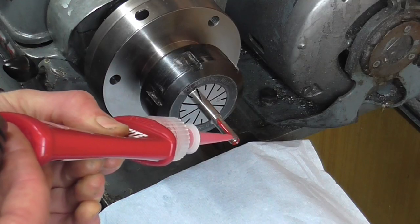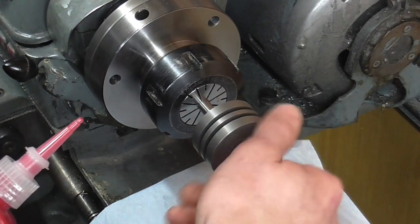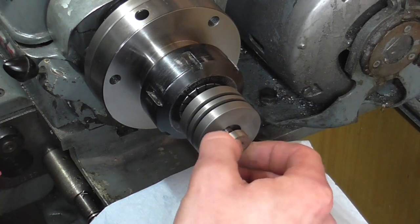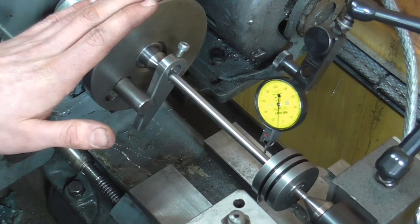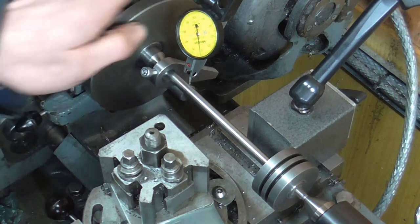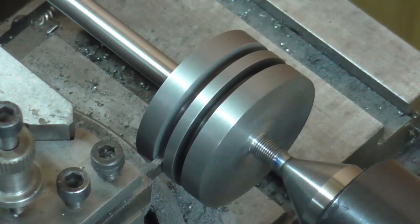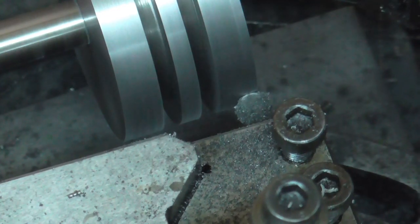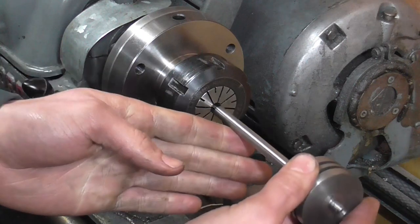On to assembly and I'm finishing the pistons once they're mounted on the rods. So they're being Loctited on with high temperature Loctite. The retaining nut goes on — you don't want your piston coming off — and the whole lot is being tightened down with a homemade pin spanner. Before finish machining I'm checking with a 2 micron indicator that the rod is aligned to the machine's axis. That way the finish machining of the piston will be concentric, and I'm then proceeding to finish up. Finishing the piston ring grooves and finishing the OD with a round nose tool — that finishing just guarantees everything is concentric and well aligned to the rod that it will be running on.